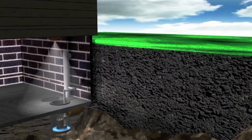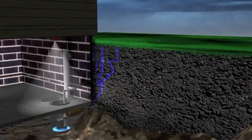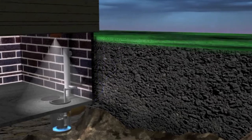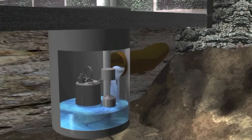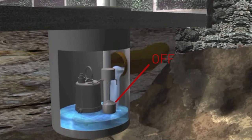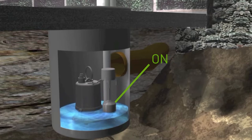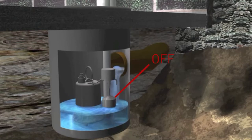Here's how a sump pump works. As water from rain or another event seeps into the ground, it naturally drains towards your home's foundation. Most home foundations have tubing or other materials that are designed to collect the water and funnel them to your sump pump pit. As the water fills up in the sump pump pit, the pump has a device called the float switch. This float switch rises and falls with the level of the water in the sump pump pit. As the level of the water gets higher, the sump pump will turn on and will flow water from the pump to piping that directs the water outside the home.